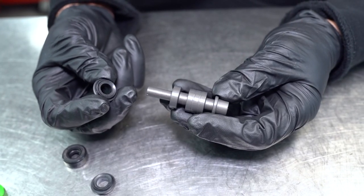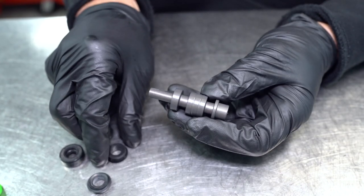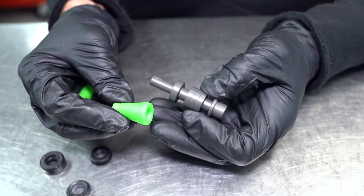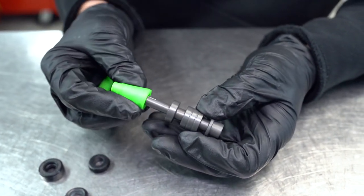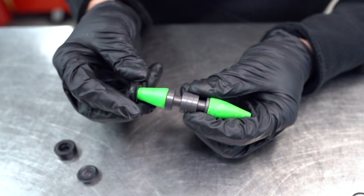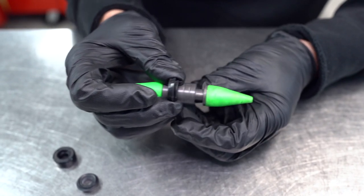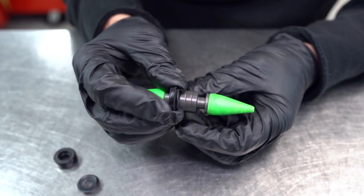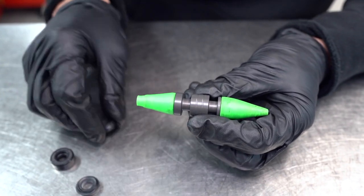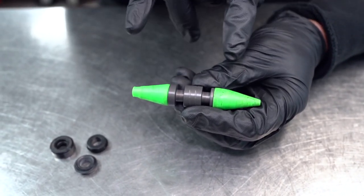These are the new seals that we're going to be putting on the piston. They're incredibly tight to get them to stretch up over the piston, so what I've got here is some 3D printed cones — you could also turn these out of aluminium if you wanted. These are plastic and they fit down over each end of the piston, and then you can slide the seals on over the top with a little bit of rubber grease. The seals are going to go in this orientation because the pump goes this way inside the cylinder and you need the lip of the seal to push in the direction you want to go to create the pressure. All these things will be available from our online store if you'd like to buy the 3D printed parts and the seals as a kit.